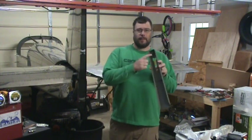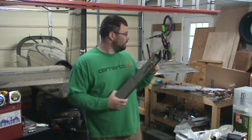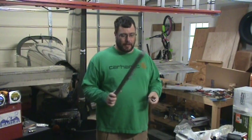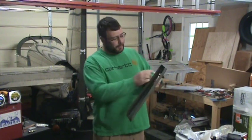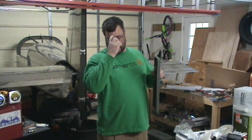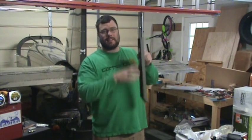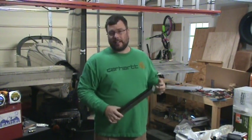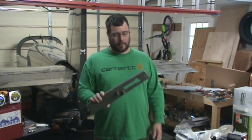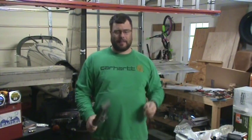I am going to be fixing this mounting point for the trim tab servo, and basically in my last video I described where I made these pieces. The drill bit shifted a little bit, and it shifted the same direction on both pieces, but then one piece gets rotated 180 degrees, making the actual shift between them offset each other, making the problem worse. And I only have this short piece of material left over.